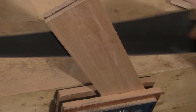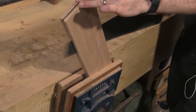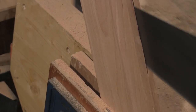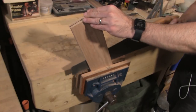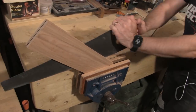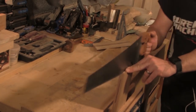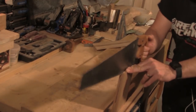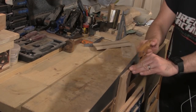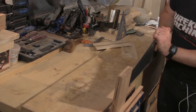Of course I'm making a lot of work for myself here. In an ideal world I'd make the box out of material that was the correct thickness to start with. I'm a great believer in dimensioning a job based on the material available, but the simple fact is it's not always possible or economical to source material in the ideal thickness. As I get towards the end of the cut I flip the material over and come in from the other side. I've placed popsicle sticks in the void to act as spacers — this stops the two halves being squashed together by the vice and keeps them parallel.